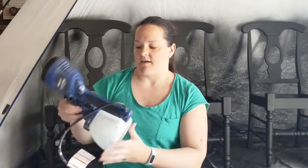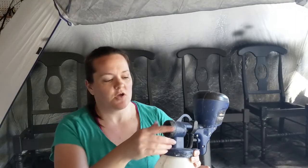Once you're done painting your furniture, it's time to put on some sealer — sometimes called topcoat. This is a really important step: unless your furniture is purely decorative and nobody's going to be using it, you really need to put a good sealer on to keep the paint job looking good. One of my favorite sealers is General Finishes High Performance Topcoat, and I'm going to be using it in satin finish and spraying it on too, so everything is going to have a great smooth finish and it's going to be fast.